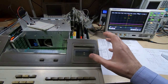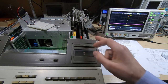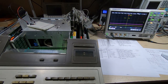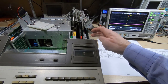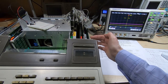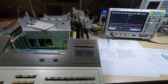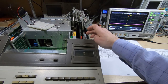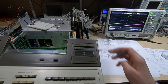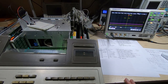I'd found some faults with the system — in particular, a couple of interesting faults with the two hybrid modules, not so much with the modules themselves but the way they are attached to the two CPU cards. I've decided to save that for a completely separate video. What it amounted to was that not all the connections on the hybrid modules were making it through to the PCB. Once I'd fixed that, I started getting some activity on the two CPU cards — before that they were completely dead.